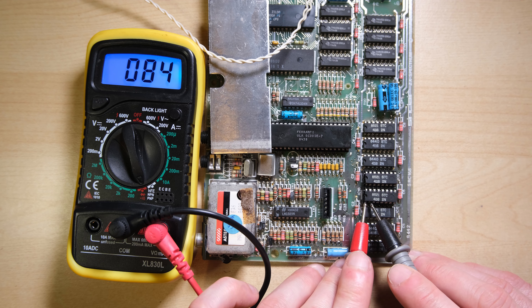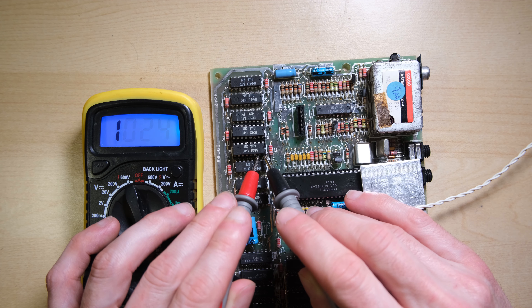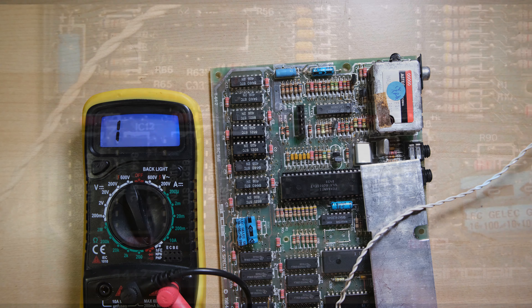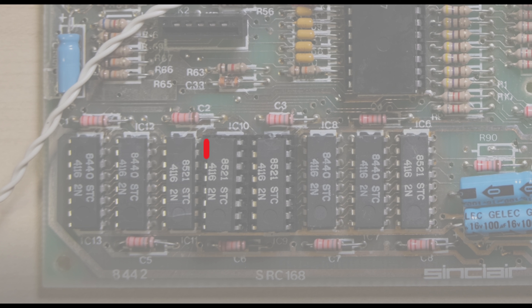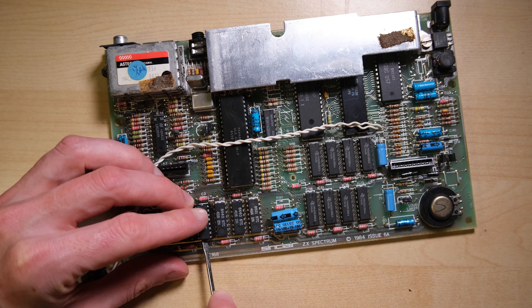This makes me interested to check continuity around the lower RAM. It's possible the minus 5 volts has been shorted somewhere underneath the sockets that have been fitted, or within the chips themselves. I started by checking adjacent pins, and I found that pins 1 and 2 were actually shorted together. On the other side of the chip, pins 15 and 16 were also shorted together. So there's definitely a problem in the lower RAM area. What we've shown is the minus 5 volt supply is shorted to the data-in signal, which explains why the voltage is high, and the ground signal is shorted to the CAS signal. It could be underneath any of these chips or within any of them, so we're going to have to start looking underneath.